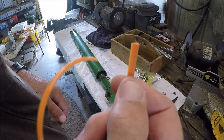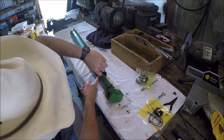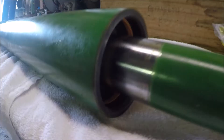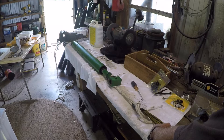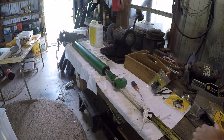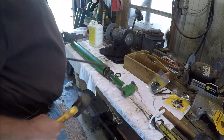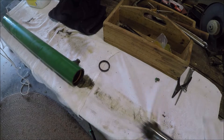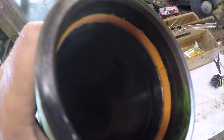It's tapered — tapered one direction. So in theory I think this is supposed to go in like this. Here's a better view of that filler ring with the cylinder rod out. You're done with it — you can take it out now. You don't need it for reassembly.